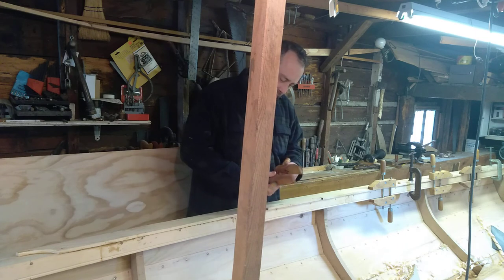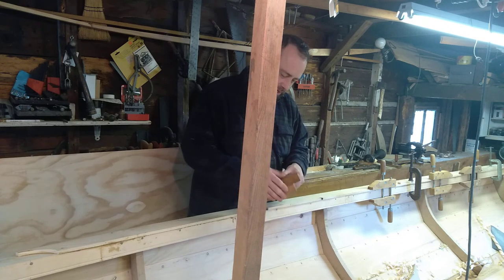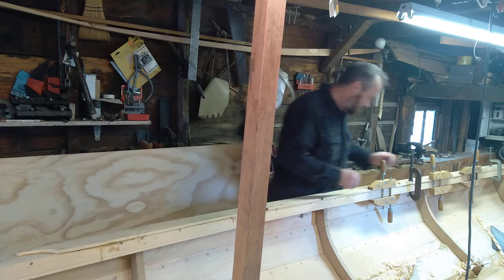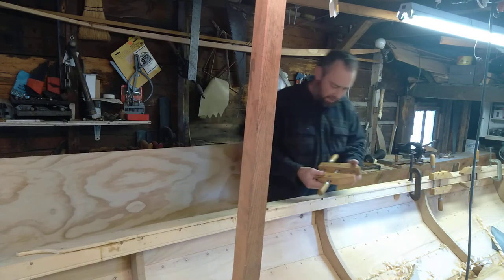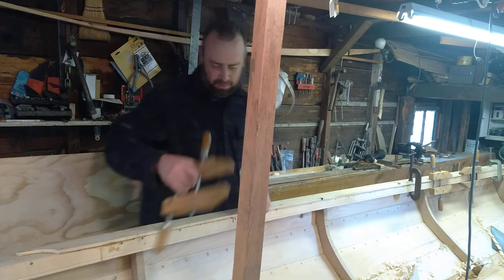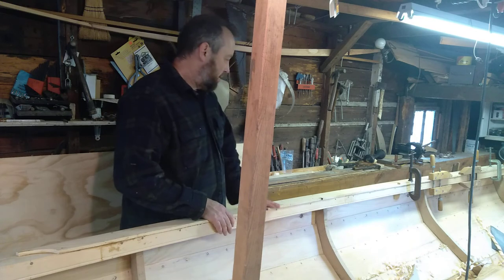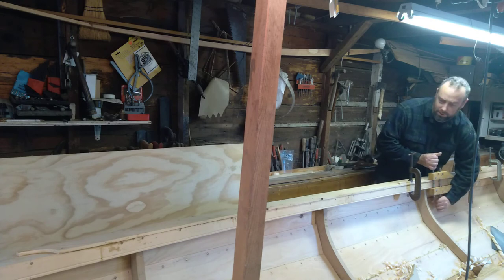Part of that is that when I first started using these clamps regularly, I gave them another coat of a linseed oiled wood treatment, and that really keeps any sort of water-based glues from adhering to them. If you had something that wasn't so much water soluble, it would probably do a pretty good job keeping epoxy from sticking to them as well. I've also got the jaws of these waxed, which will really help with epoxy.